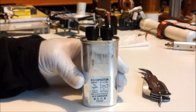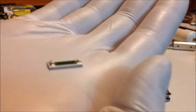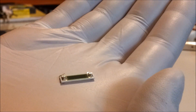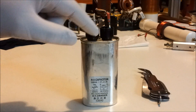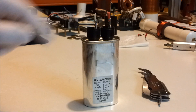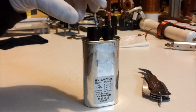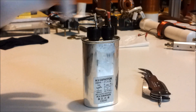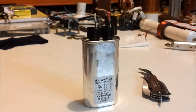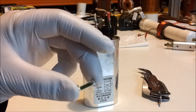The reason we're taking them apart is to get to these little guys here. That is a 10 mega ohm resistor which is located inside the capacitor just at the top, just underneath these two terminals. So we're going to have to take the cap off, remove the hood, and underneath these terminals on the inside we'll be able to get to the 10 mega ohm resistor.